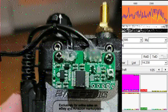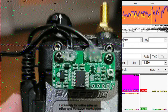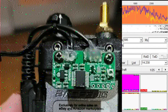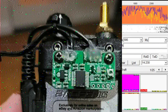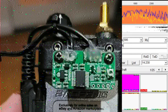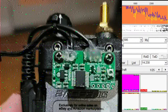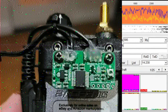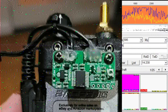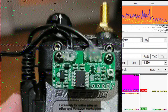Yeah, you did a pretty darn good job describing exactly what's in this photo. This is that microcontroller that controls the fox for the fox hunting beacon. This has a connector that is a standard Kenwood connector that tells the radio to key up the transmitter and then plays the audio over it. And then the other wire that you identified as going off the screen, that's just the power. It runs off of a standard 12-volt power supply. So I give it 12-volt power from that Ryobi battery. And then I connect it with just an SMA connector into the Fox and the antenna. So it outputs about 5 watts.